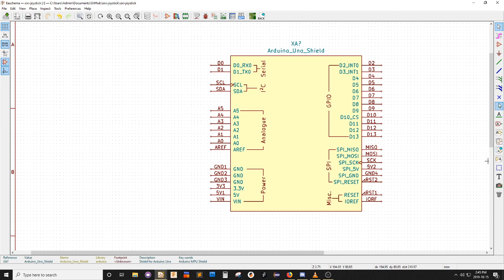So let's first start by getting rid of everything we don't need. If you've seen my drawings on Instagram, you may have seen recently I was designing a case. And along with that case, I had a little circuit board that hangs off the side of the Arduino. That circuit board is the one that we're about to make. So I can get rid of all of these and this. I want a ground. I want 5-volt power. And that should be it, actually. It's a very simple circuit.